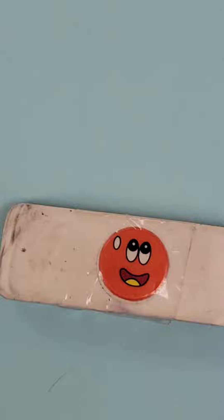All right, on this side here, we know originally we came up a half an inch. We told you to come in horizontally, right? Do your horizontals first. Because if you do your horizontal layout first, right, burn it half an inch, come over this side half an inch, I can stay within my border and lay this out. And then when I did that, I did it up top as well, right? That's how we get away with using benchmarks.